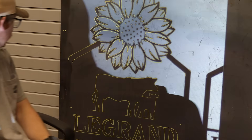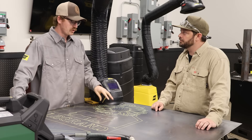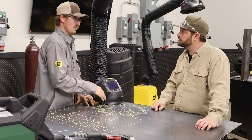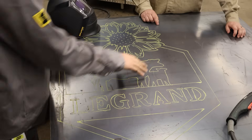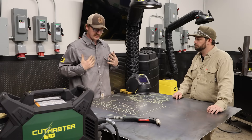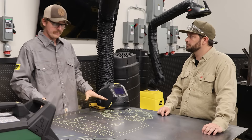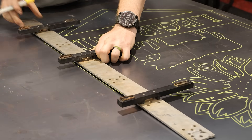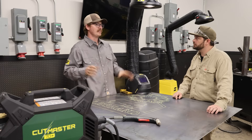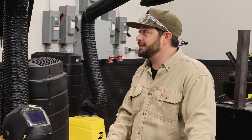There are some tricky parts here. With the flower, we're going to put a lot of heat cutting all these individual petals, so we're going to start there — it's going to naturally warp. Then I'll come down to the letters and start cutting there. That residual heat up top will drag through the material, and by the time I get down here we'll have balanced heat. If you always go left or right you end up with a banana chip. The last thing I'll cut is the actual border — cutting the border last gives the perimeter one final heat so it has a chance to contract and expand, releasing all that stress.